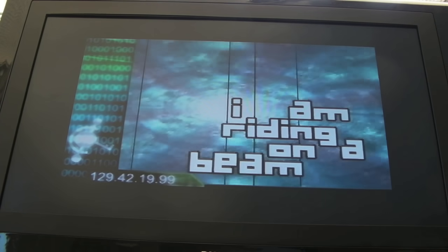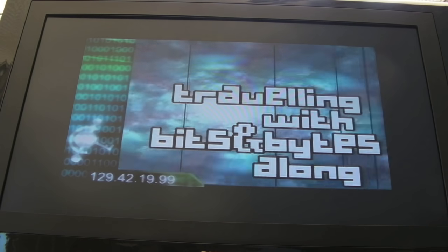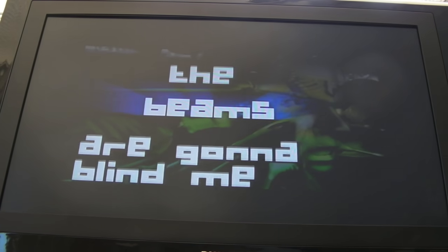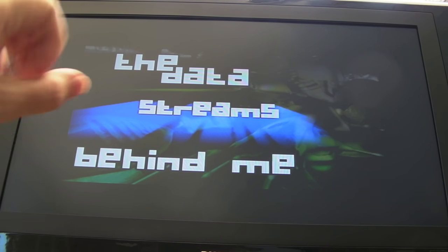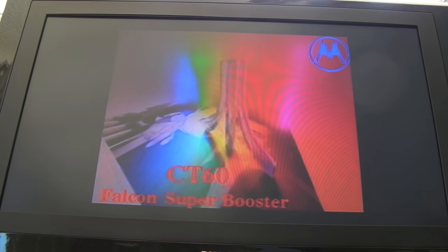The clock gets split three ways via some resistors. This bit always works — it's when the scene changes that you get a crash. There are four different scenes working on this first one. There you go — got a crash. It's consistent — it happens on the first, second, third, or fourth scene change each time it hits the disc. The other thing I noticed in terms of instability besides not being able to play that demo is Quake — and this issue is more common when it's warm like today.